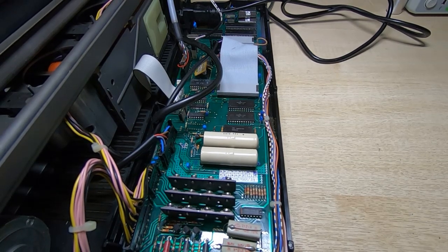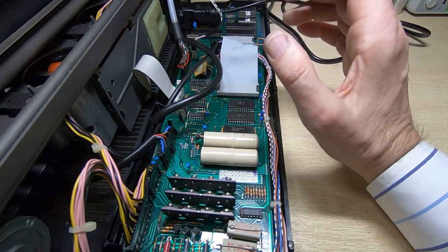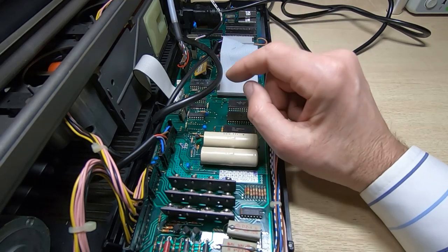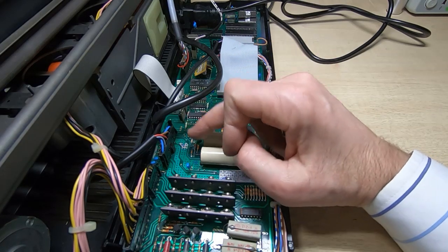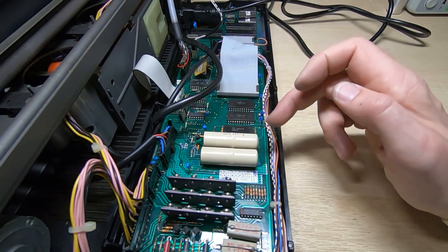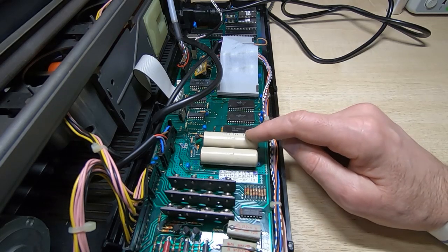Still the same. So I'm now going to focus on the obvious area. We could throw a scope on this and see if the processor is running, if the supplies are correct, but really it's about looking at the physical damage. The obvious place is here - we've got the two batteries. They might just be completely dead, and depending on how the system is designed that could stop the system booting up. I'll remove these shortly.